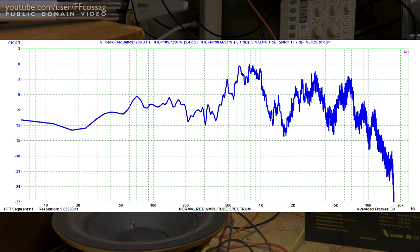Here's a quick frequency response for the entire system. This is for the open-air enclosure, so the low end is going to be all weird and odd, but you can see there's a giant rise in amplitude as we move towards 1kHz, and that pretty much stays high until we run up to over 10kHz. So I'm just going to snag a 10 ohm resistor out of something, put it in series with the tweeter, and we'll try again.